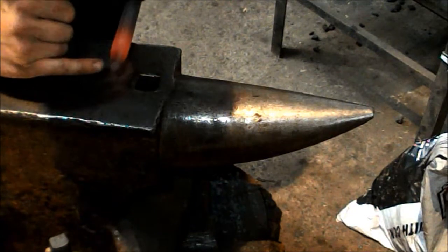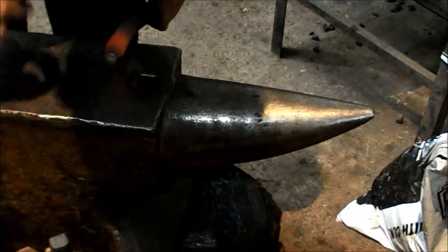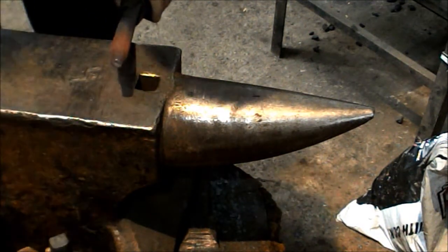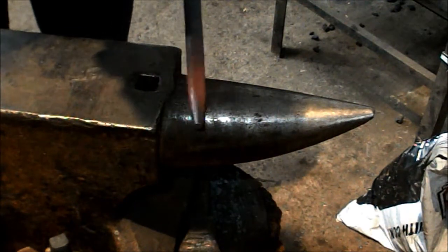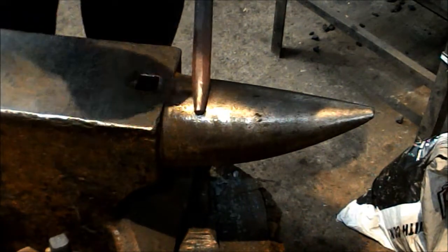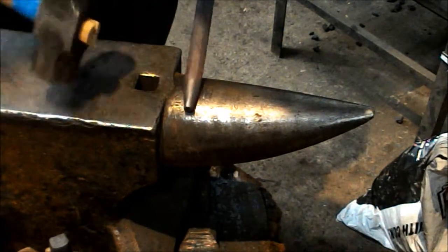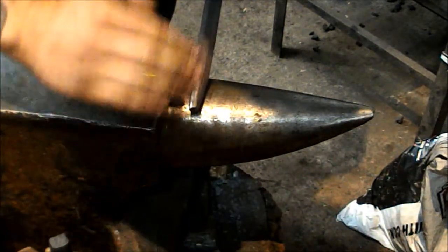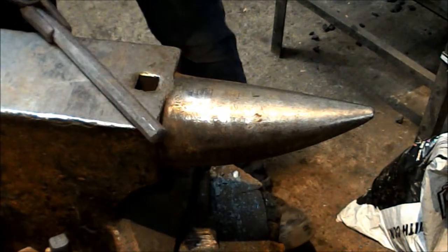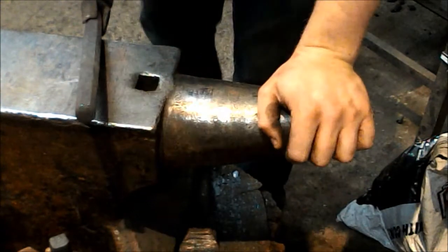With a slightly colder forging, the end's starting to fish lip slightly, and that's normally the reason, because you are forging too cold. So if you're getting a little fish lip, it's probably worth pushing the temperature up a little bit. Also, increasing your PSI is important, so nice big taps with a slightly larger hammer moves more of the internal material, which gives you a bulge. So if I show you on the other end, this was done with a power hammer and it was done at quite a heat. There's a nice little radius on the end there.